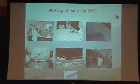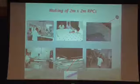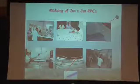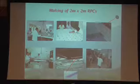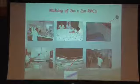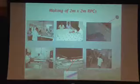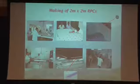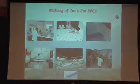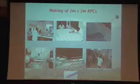So we're handling this glass, it is simple, the float glass of 2 to 3 millimeter thick and 2 meter by 2 meter. It's very fragile to handle. So you put them as two gaps. It's basically by these buttons in the middle, in some grid of 20 centimeter grid, and then put the top glass plates on top of that. And then at the edge of this one, you put these kinds of spacers also, and then you put a gas inlet, gas outlet, and make the gas gap. Once you have the gas gap, then you put the pickup strip on the top and bottom, apply high voltage, and so on. Those are simple methods.